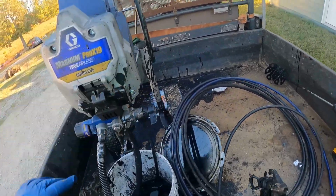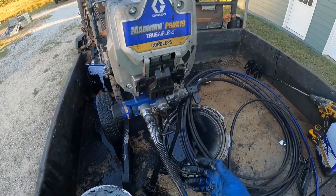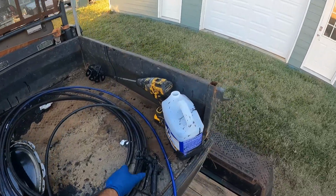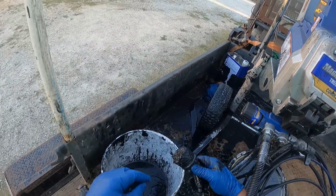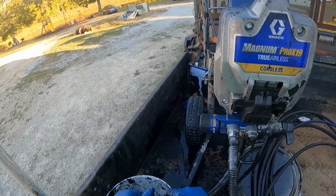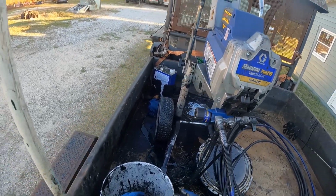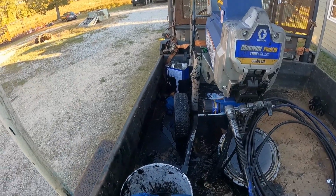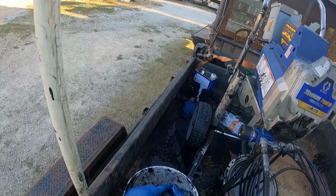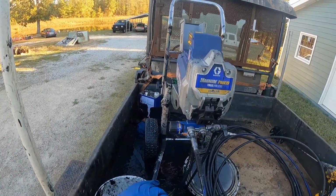So I'll cut it off at this point, pull the tubes back out, and I don't wipe the tubes down or nothing, because I'll let that dry overnight and I might wipe it off tomorrow, but it's almost impossible to clean up. What I do is take this pickup screen, and you see over the day some of the paint that starts partially drying in the buckets will flake off. Paint that's dried on the tube will flake off. You're inevitably going to get trash, maybe stuff blowing into your buckets of paint when you're out in the field painting fence. So I'll put this down here and try to clean this screen off as best as I can. I'll take a brush and brush this paint off, and then on my gun, I take my tip off.